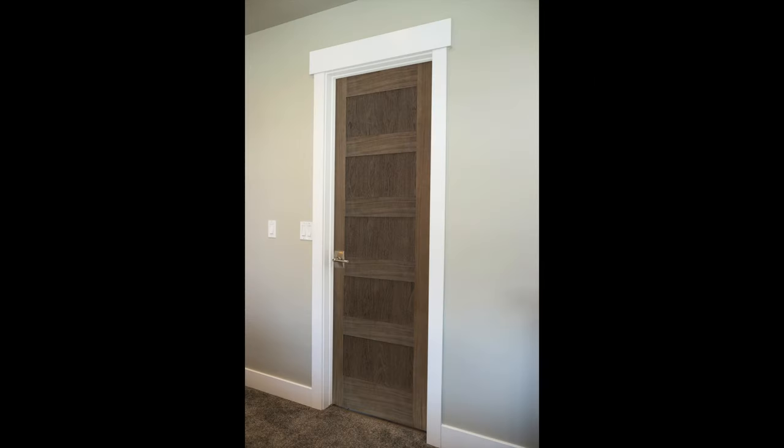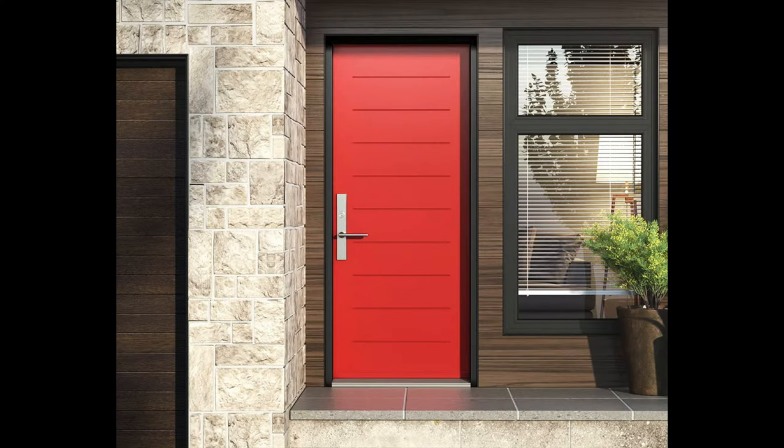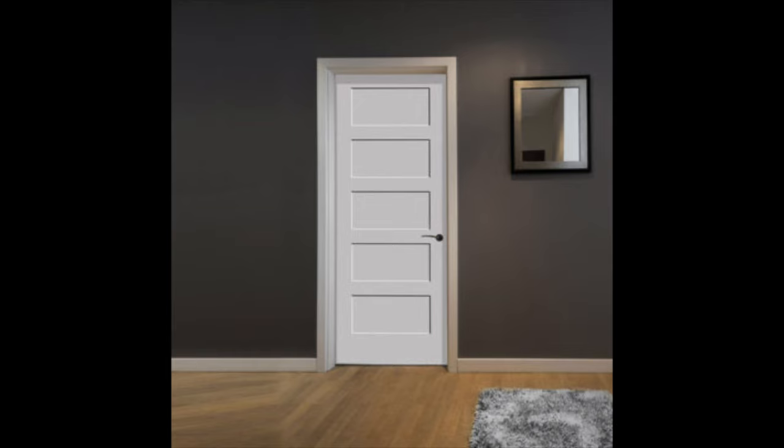A solid wood door is better at blocking noise than a solid core door, but it's quite expensive — from a few hundred dollars to well over a thousand dollars. It is worth it for a lot of people, especially if you're recording music or podcasting and really can't handle noise going in and out of the room. You can go even a step further and install a fiberglass door. These block a little more noise and are more expensive, similar in cost to a solid wood door — a few hundred dollars up to over a thousand, depending on the look, style, and size.